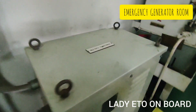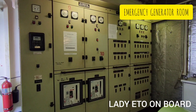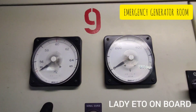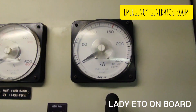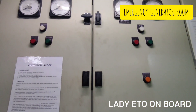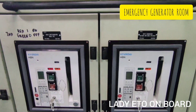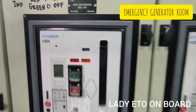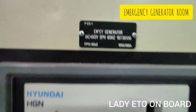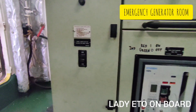Transformers. On the emergency switchboard there is a frequency meter, voltmeter, ammeter, and kilowatt meter. There are air circuit breakers — one for bus tie, which will connect the main switchboard and emergency switchboard, and another one for the emergency generator to the emergency switchboard.